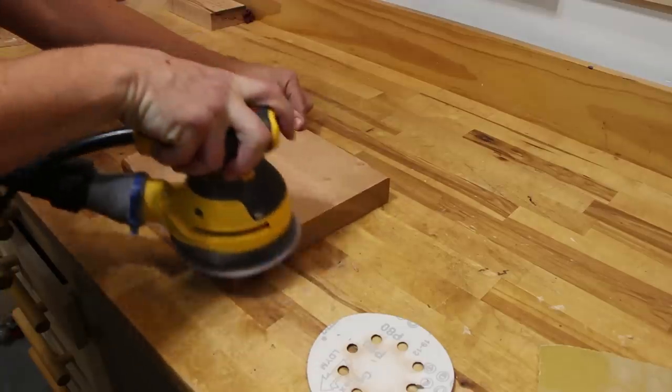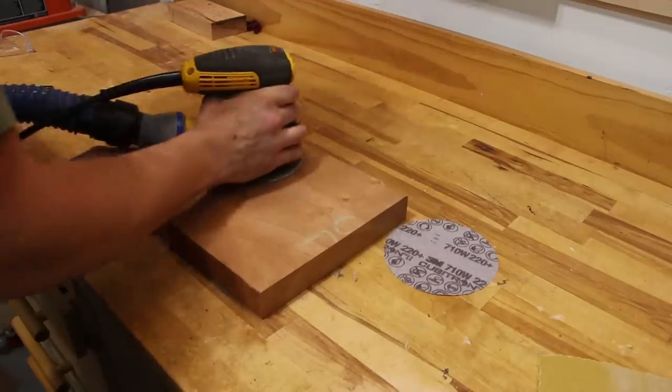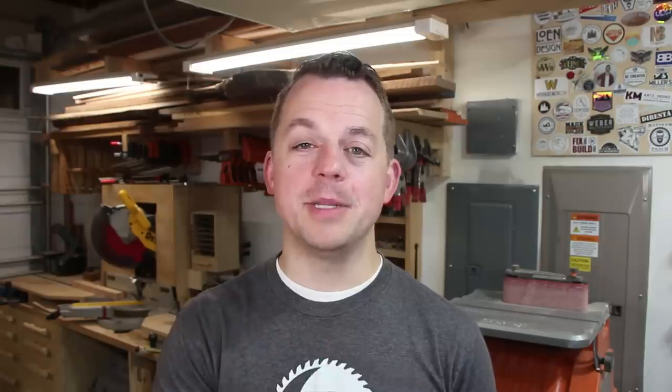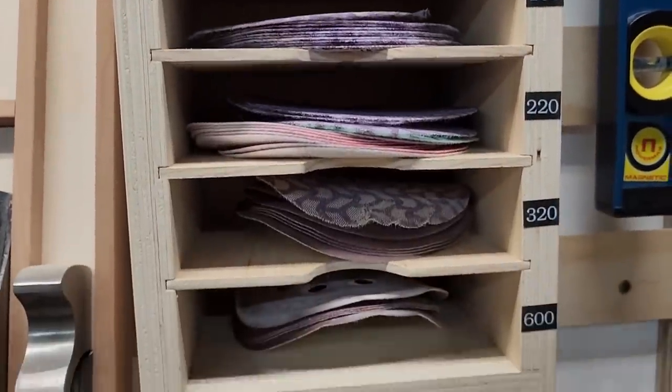The next thing that I wish I knew about earlier is sanding. Sanding is one of those things that nobody really likes. Sometimes people will get impatient and start sanding with an 80 or 100 grit and then move immediately to 220 to make it really smooth. What you should be doing is stepping up each time: start at 80 or 100, then 120 or 150, then 180, then 220. That way you're sanding off the roughness of the previous grit. If you skip grits or don't sand enough it leaves a rougher finish and you're going to regret that when you see your final piece.